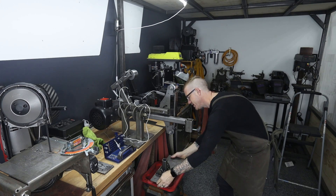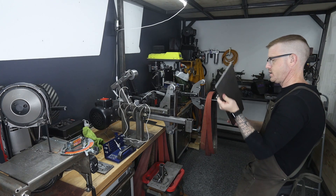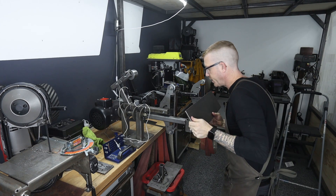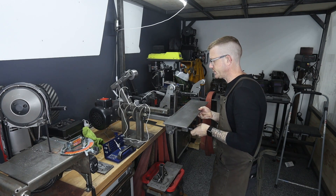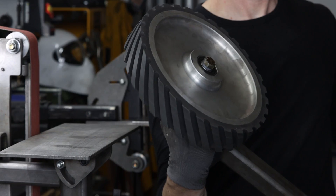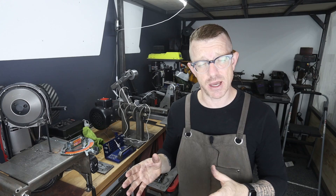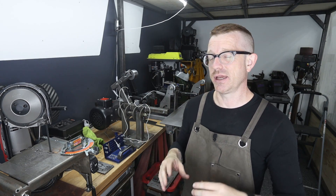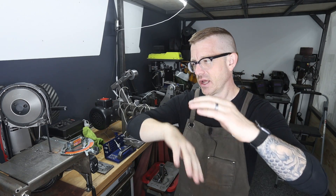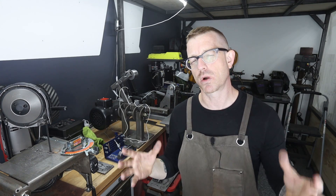So we take the one that's in the plan set, put this big one in, set it down in there, lock it into place, slide it in and it works great. I do have a 10-inch contact wheel that I'd like to be able to use vertically and horizontally, so I want to create a versatile work rest for it so that I can turn the thing on its side and utilize all that nice contact wheel space, but also have a work rest that works along with it. That's what we're going to build today right here on Housework.